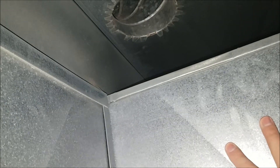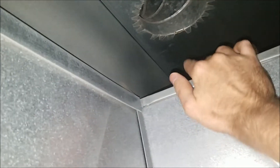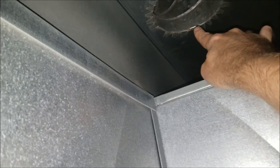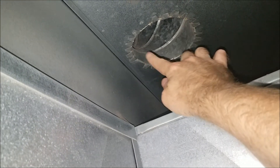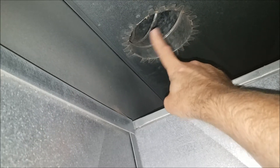The air goes into the plenum here — one end goes down this way with a six-inch duct that feeds a room, and the rest of the air goes down the other way to feed the rest of the house. I've got to take all these walls off and install the new Mr. Cool air handler and do some minor duct work. I don't like that the humidifier causes some rusting here on the outlet — that's why I want to get rid of it.